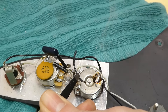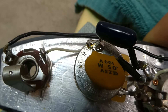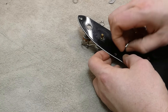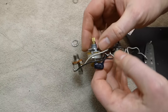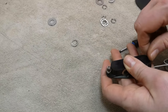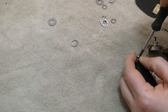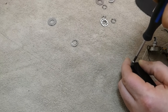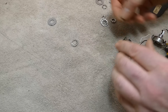Just looking at the way this ground wire is connected, I would suggest that's not factory original — or maybe it is, which would be sad. I'll go ahead and pull off the bridge ground. The tone pot seems to be a CTS from 2006 — that's 18 years ago now, folks! That pot also had a couple of pretty thick hardware store washers on it. Always take an extra second and put the screws back on the pickup, because if you don't, they will certainly go missing — and you'll have a fun time trying to find new ones.